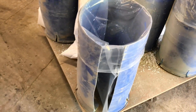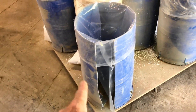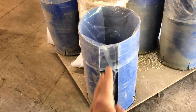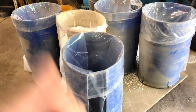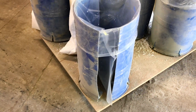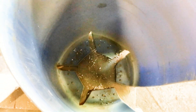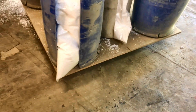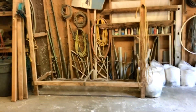People have asked about these drums — I custom-made them from a 55-gallon drum, sized the diameter to fit the bag. I put a slit in the drum because when it's full of material, there's a vacuum issue and you can't pull the bag out easily. With that slit, air sucks in and the bag comes out effortlessly. I took the 55-gallon drum and cut it so I could screw it together — there are screws all the way around holding it tight. Then I put it on a four-by-four piece of plywood on two furniture dollies, so it moves easily even when fully loaded.